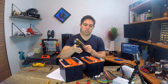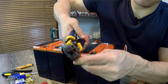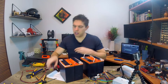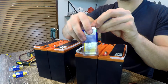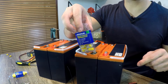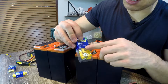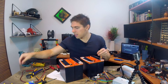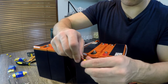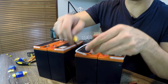I'm going to use some wire strippers, and the process is the same each time. I strip the end part of the wire, then twist it to help keep it neat. I've got these crimp terminals — it's really important to match the size of the ring to the size of the terminal. These are 6mm wire and this stuff just fits. Insert, twist as we push in, and what we're aiming for is it poking through like that.